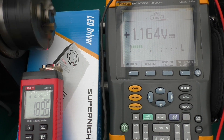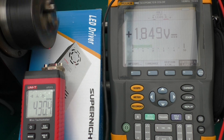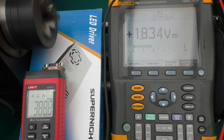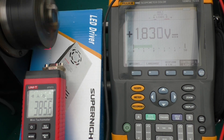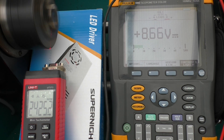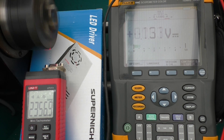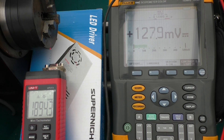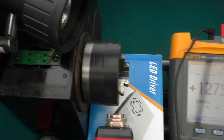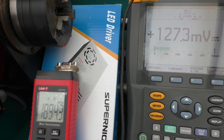Now we're roughly getting about 1 volt and roughly 190 RPM. If I speed it up and take it up to 2 volts, we're going up to about 300 RPM. If we hold the button and take it up to the maximum — although it's showing 9.2 volts it will drop back to about 8.4 volts. I think there's an optical encoder on the chuck which limits the voltage to 8.4 volts, and on the RPM we're now showing 2,455 RPM. The 2,400 RPM is what the manual stipulates this runs at, so that seems to work. The optical encoder is just inside there, and it probably reads the speed of the chuck and then alters the PWM signal or the 0 to 10 volt reference accordingly.